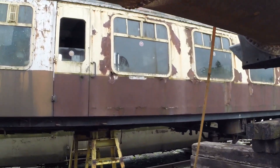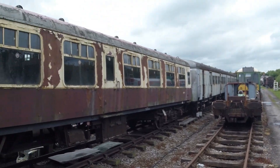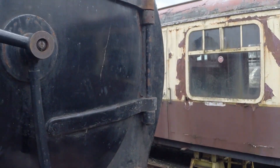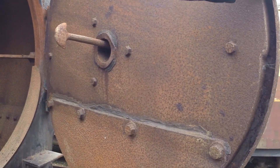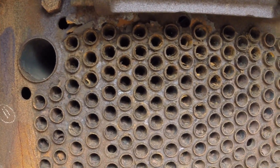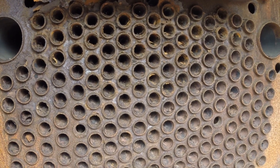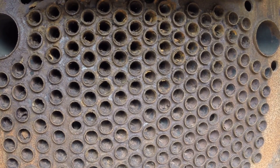Let's hop up and see what we can see up at the front of the smoke box. All of the tubes need replacing — we'll probably do that on site, which will be quite interesting. We'll get the camera on that because it's quite an operation replacing all of those. The tube plate that they sit in also needs replacing, so I think we'll be doing that too.